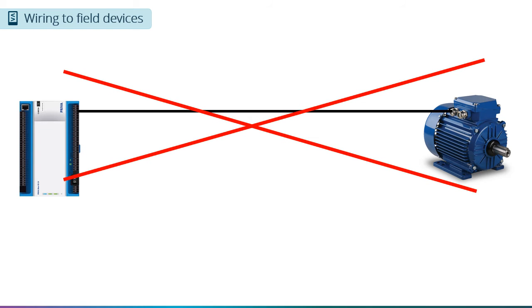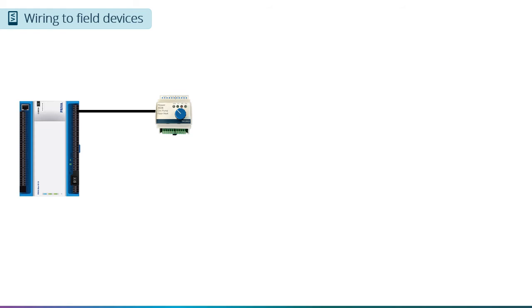The current ratings for the relay contacts are located in the installation manual. Although the ratings do in theory allow you to connect the compass digital outputs directly to some field devices, please do not do it. The relays have a mechanical life of about 300,000 operations, but the electrical life is less if you put a lot of current through it.